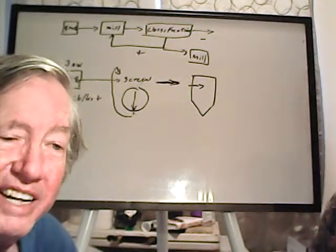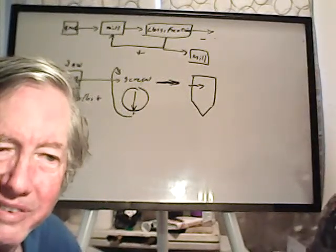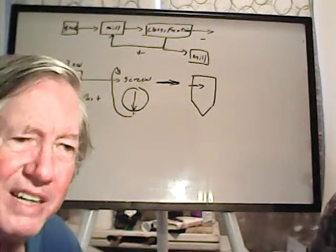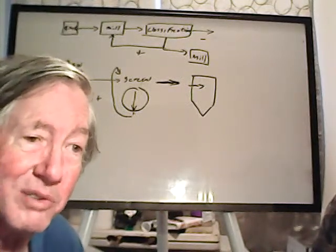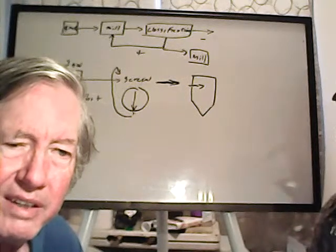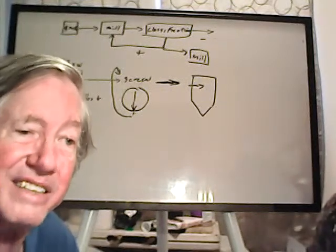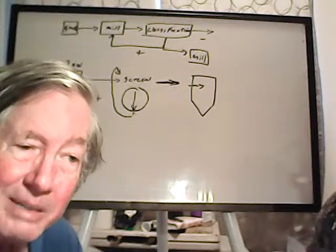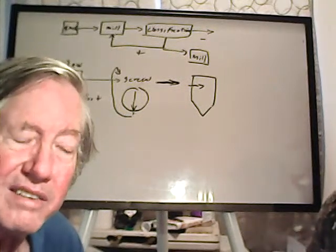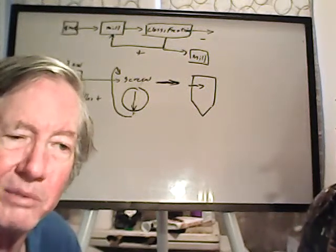Another thing is I have to ask, the rate of heating slows. Yeah. I say that it seems to me that what the manufacturer was saying is because it's got some crap on it, which I presume to be mainly soot from resin, the wire itself becomes somewhat thermally insulated, and therefore winds up operating at a higher temperature because it's not getting rid of the heat as fast. So that's why I was saying if I can cut the actual operating temperature of the element by a little bit, it should make it more durable.